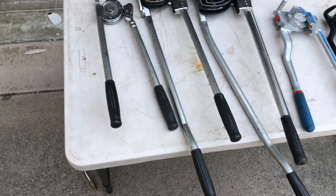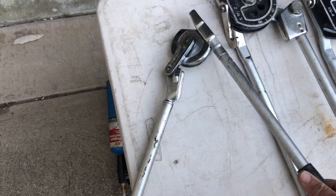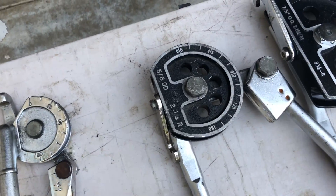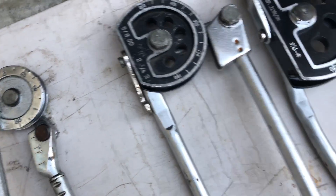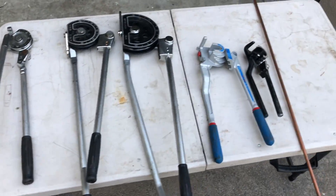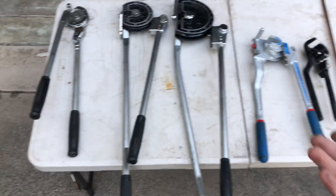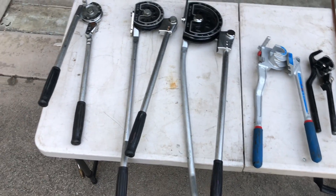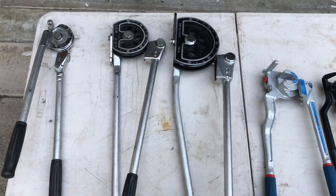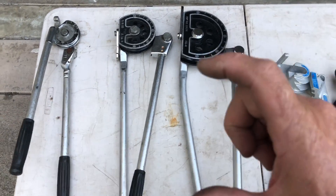First, I'll show you the benders I use. These are just regular old standard Imperial benders. This one's for half-inch, so I rock a half-incher. I rock a five-eighths. I rock a seven-eighths. Anything over seven-eighths, I use fittings just because I don't have a bender that goes bigger. They probably do make benders that go bigger — I don't have one. I never have had one in my 31 years of doing this. When I get to line sets that big, I'll use fittings, big elbows.